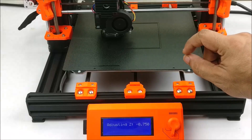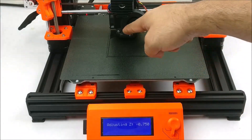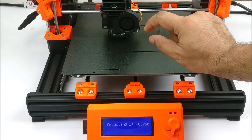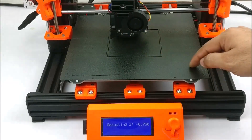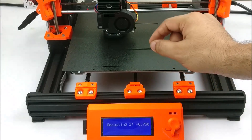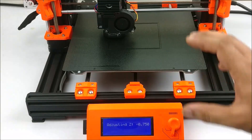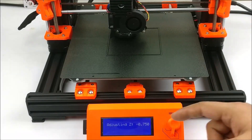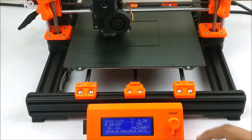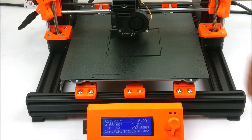When you decrease the gap between the nozzle and the plate, remember do not overdo it. You will always have to watch the first layer as it prints, because if you decrease the gap too much the nozzle can crash into or dig into your plate. Always do it in increments of twenty or twenty-five and then wait for the result to appear. Especially when decreasing the gap, keep a visible check on the first layer that is printing so your nozzle does not dig in.